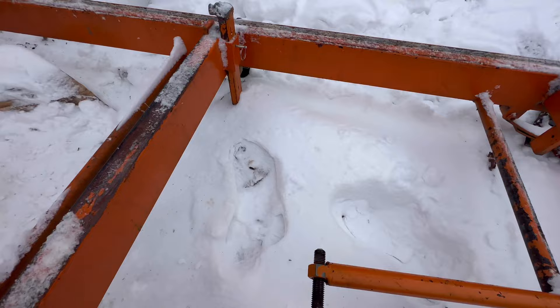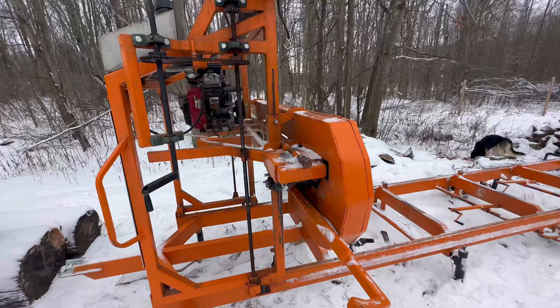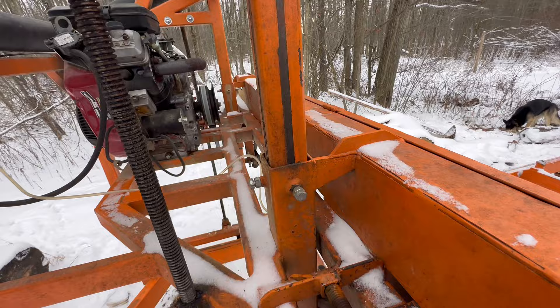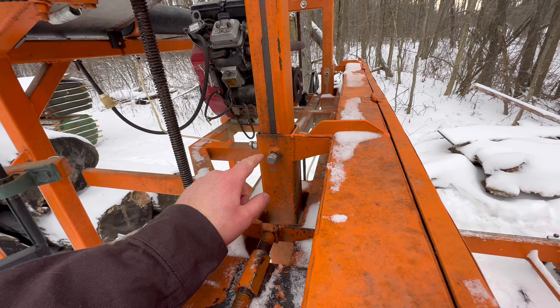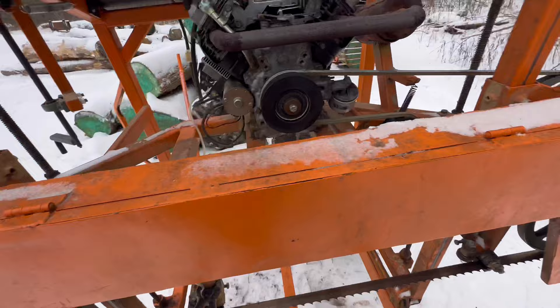Here's how I got the blade going up and down on the carriage. I got this — I think a two-inch tube and maybe two-and-a-half — so there's room to play in there, and I got these adjustment bolts to keep the blade level. I was thinking about making some fancy bearing mechanism so there's less resistance, but this actually isn't too bad. I grease it every once in a while and that seems to be fine — easy way of doing it.